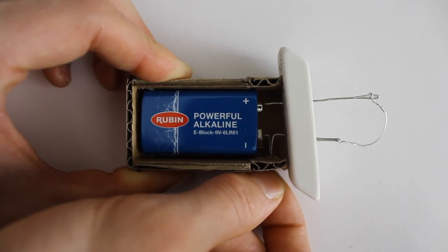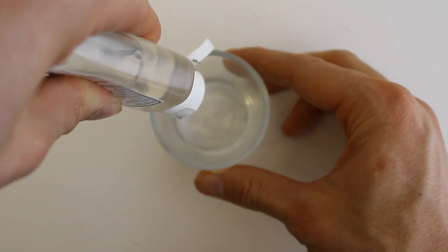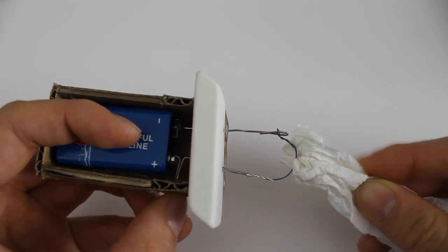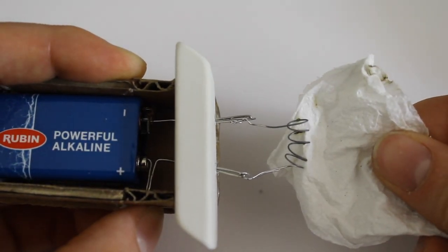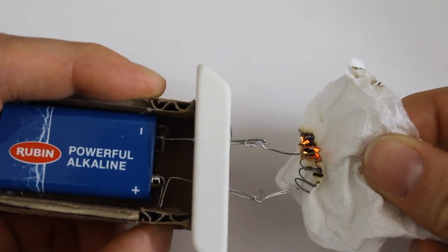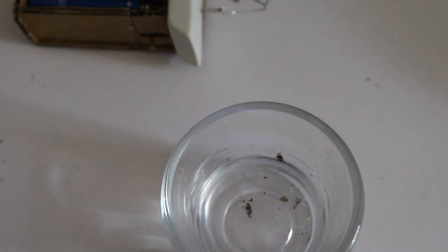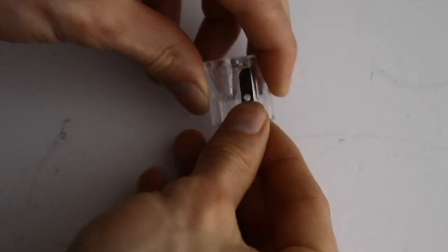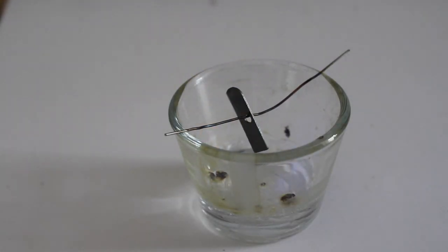I'll add a little switch on the side so we can turn this makeshift lighter on and off. My office has at least a million hand sanitizer stations — I'm going to put some into a small glass. And like Thomas Edison, or Joseph Swan, or whoever actually invented the light bulb, the first few choices of filament are unsuccessful, until I try a longer section which increases the resistance relative to paper clips. This does the job and creates enough heat to glow red hot and light some toilet paper on fire. I need a clean, steady fire — that's where the hand sanitizer comes in. The ethanol burns in a controlled manner and doesn't produce smoke. Now we can grab a piece of steel from the pencil sharpener and hang it over the fire. After a while, I blow out the fire and the blade has been oxidized — you can see it's taken on a bluish color.